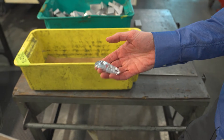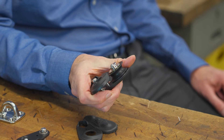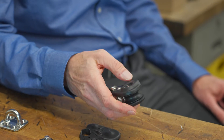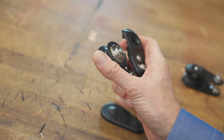The button design is domed on top so that it picks up a ramped groove in the opening cheek, and has a very positive spring-loaded click when it unlocks, so you know for sure that it's closed.